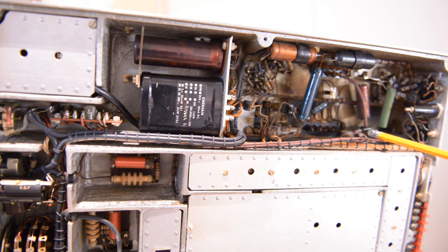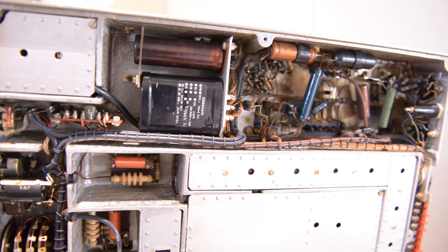I see here a double resistor in parallel — that is original, and I think this receiver has not been worked on before, so these are completely original. The front end is probably not working. It consists of a double triode, ECC189, connected to the same voltage point. You have the first VFO and the first mixer. Presumably, if that voltage is too low, the chances are that those front-end valves are not working, or there is something else going on — something that is shorting the voltage or whatever. I have to investigate that.